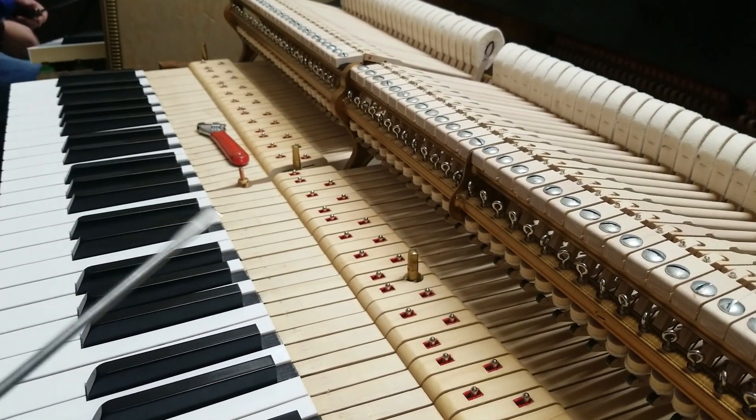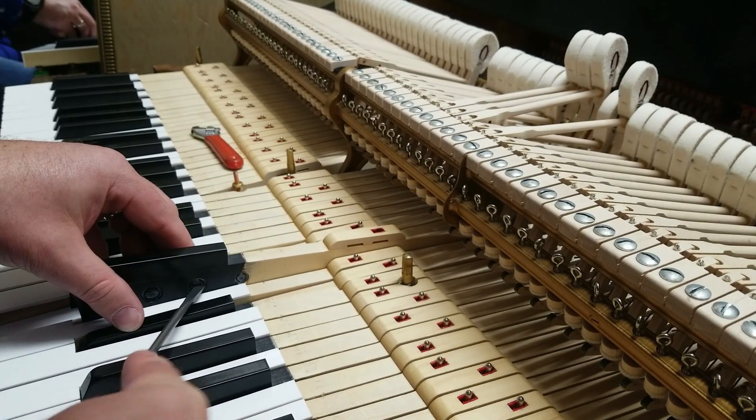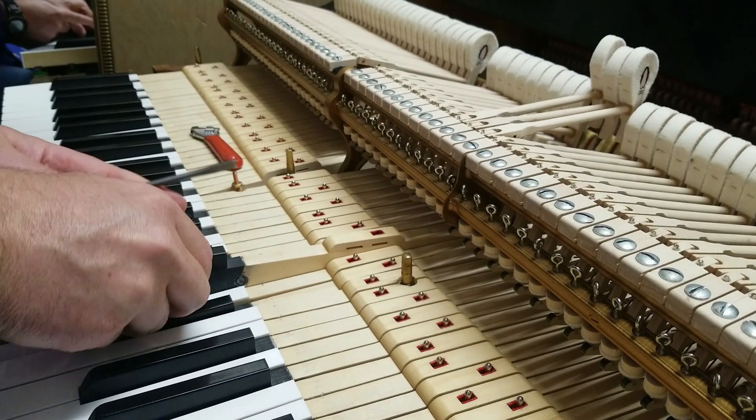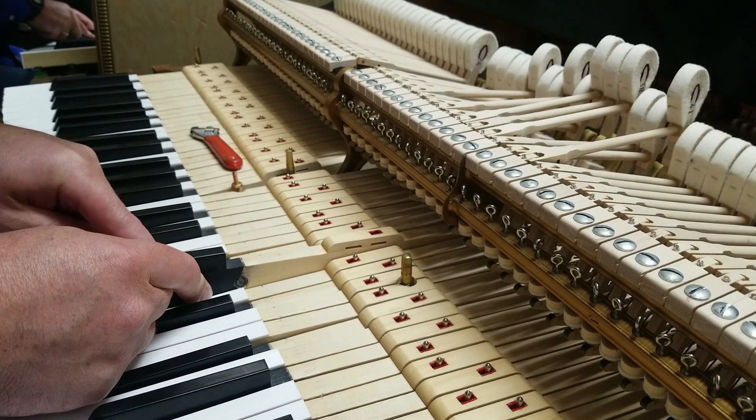In this case I'm going to swedge the key lead a little bit with my screwdriver, push it in here, and see if I get enough pressure. The lead is so soft it just molds and tightens up in that hole. I want to go from both directions.